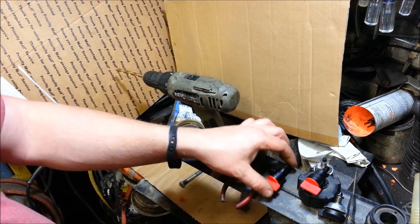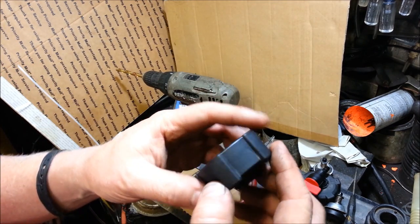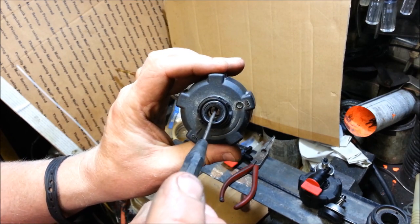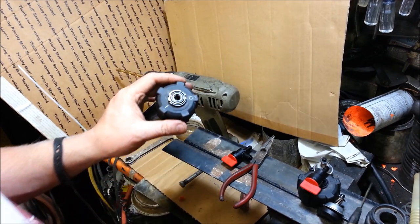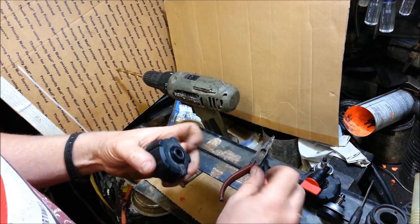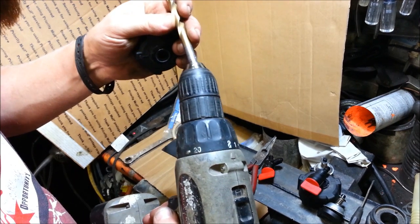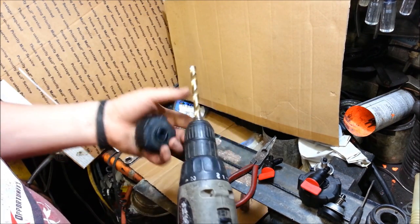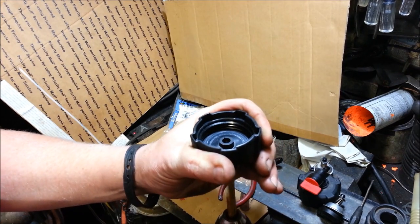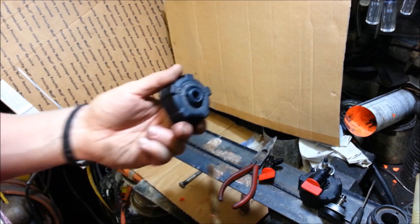The only modification you have to do to this cap is drill it out almost all the way. There is actually a lip down at the very bottom, and we're just going to drill it down to there — just to be able to accept a barely larger size to allow these threads to grip. I'm going to take a 23/64th drill bit and drill this in, watching the side until I get to the right depth. I still have my lip and just barely removed any material at all.